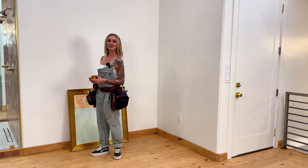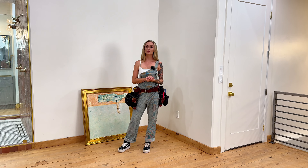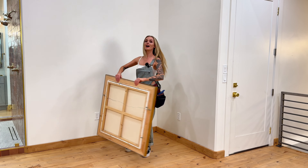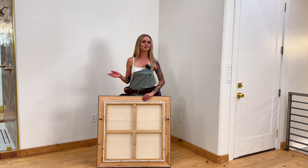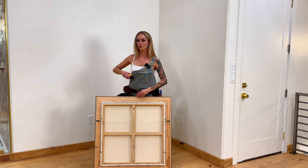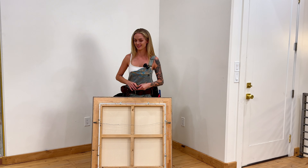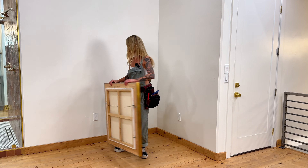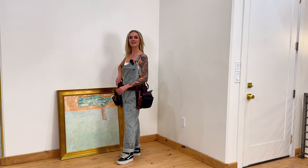That's at 86 inches, so let's find 43. Now we need to mark where we're going to screw into the wall. I'm going to flip my frame over and measure from the bottom of my frame, since I had a friend help me mark the bottom of where we want it to sit, and measure to my wire. Make sure you keep your wire taut when getting this measurement so you get an accurate reading — about 27 inches. I'll measure from my bottom mark up 27.